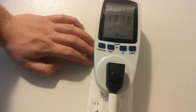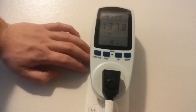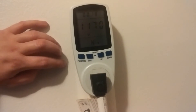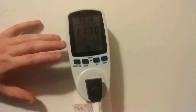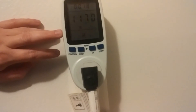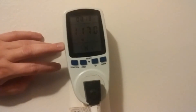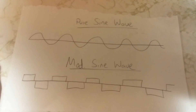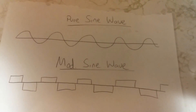That's why it's important to get a kilowatt meter and let it run for a few days, so you know the peak wattage and what size inverter to get. Otherwise you're at risk of damaging the appliance or the inverter. Get a kilowatt meter or a DC meter, whichever you need, and measure everything about the appliance — without knowing, you're going blind. If you've got any questions, ask me, subscribe, check out my channel, and I'll see you guys later.